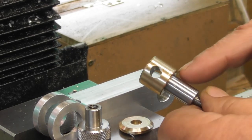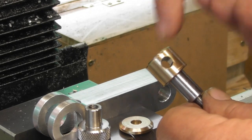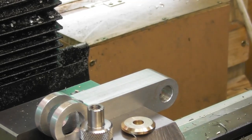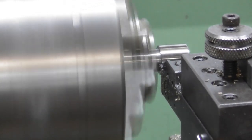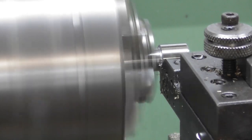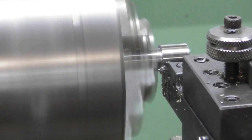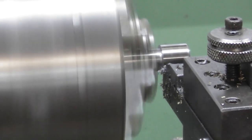And I'm going to machine a bit off the underside of the shoulder on the metal part to bring this back flush. Probably about 30 thou. I may be able to just... yeah, we'll find a way. So I've just put the parting tool in, locked it. 30 thou step back, or 3/4 of a mil. And just going to wind in, drop that shoulder back. A touch deeper. Little tiny undercut in there, not worried about that, at least I know I'm into the shoulder.